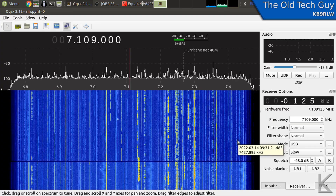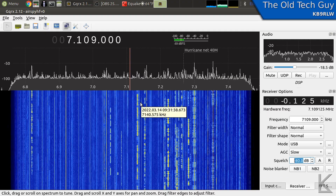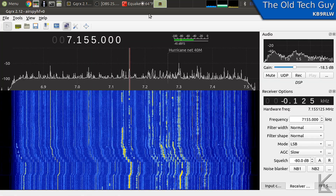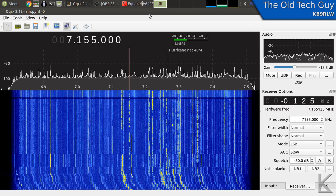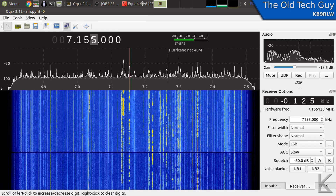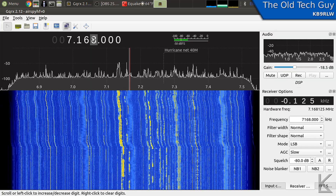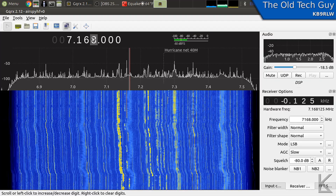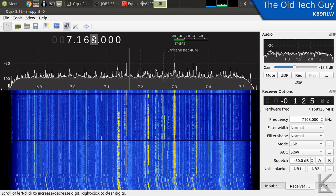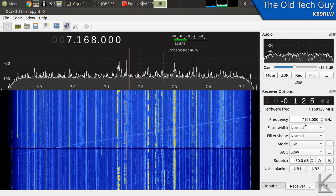Now there was a big noise source right there, and this is on the EFHW half wave. Let's move a little bit. Pay attention to this hash — these are inverters from other RVs around me. That's the kind of hash noise that you see from an inverter. Now watch that when I switch to the doublet — this is the doublet, and as you can see, that hashy noise just completely went away, leaving us with just signals. Let's go ahead and open the squelch so we can hear the difference, and I'll find a signal that we can listen to.